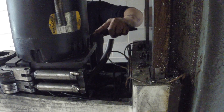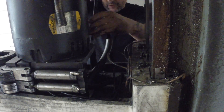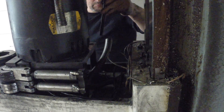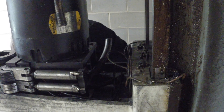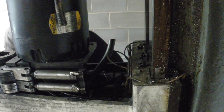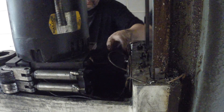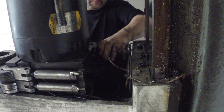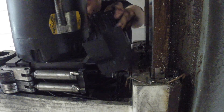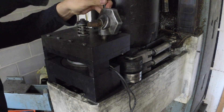What we want to remove now is an aluminum block that guides the straps. To be able to remove it, we need to take this screw out and also this standoff here. Even then you have to find a way to take the block out — there you go, that's what we wanted out. You need to remove this if you want to change the straps.